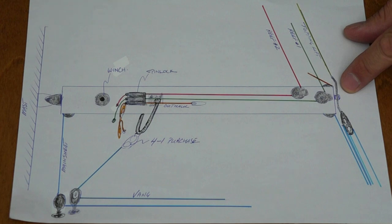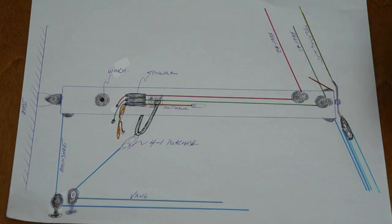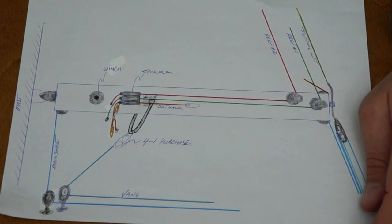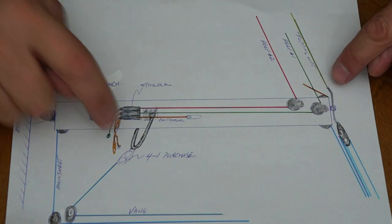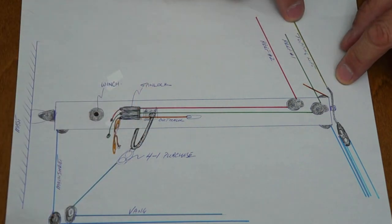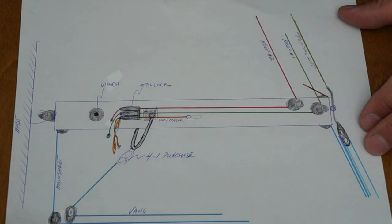The topping lift will attach to a stainless swivel at the back. Whether we do that with a clevis or just tie it on, we could do a nice bow in there at least temporarily. It's a fixed topping lift on Windover, which doesn't allow for much adjustability. Eventually I'd like to either have a rigid vang or run this up through a block at the top of the mast for adjustability. We're also going to be adding cheek blocks here and here to the boom for reef number 1 and reef number 2.